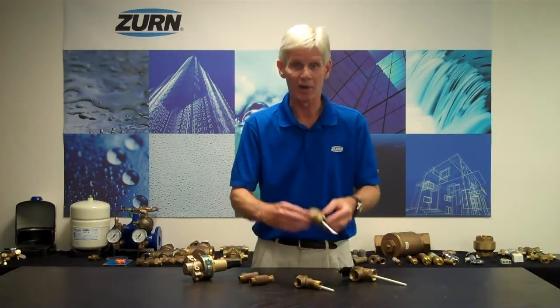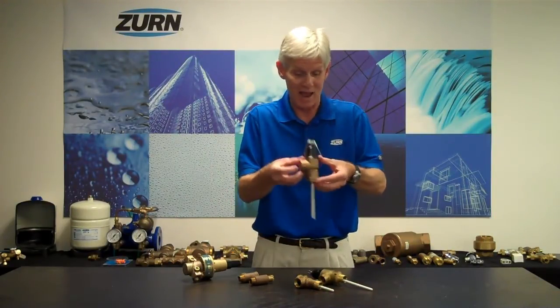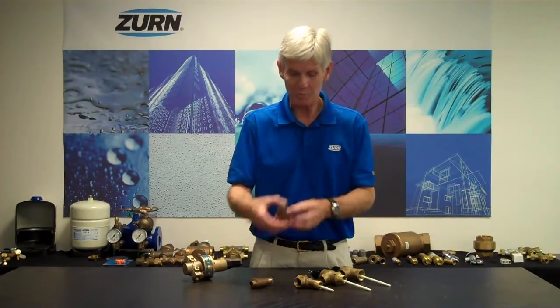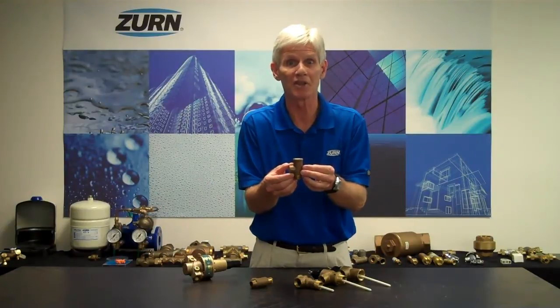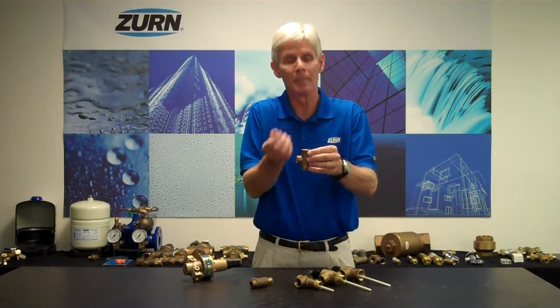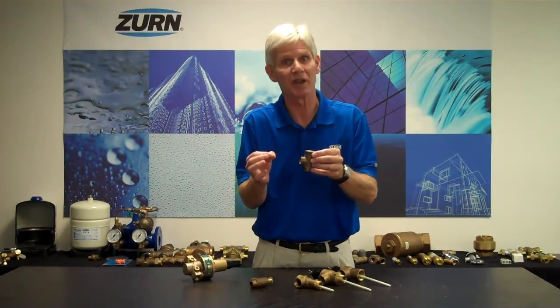Now, all the other relief valves I have here — for example, a TP220, a TP3000, and lastly my P1500 — these are all designed as safety relief valves. When safety relief valves open up, their closing point is 80% of their set value. To give you a generic example, if I have this P1520 set at a value of 100 PSI and it gets popped open, the pressure goes high and pops open, this valve may not close itself off until it hits 80% of that set value.